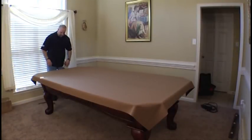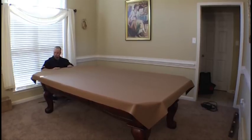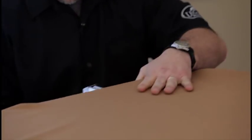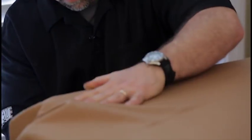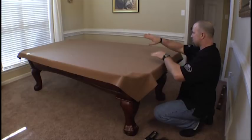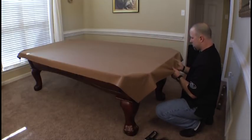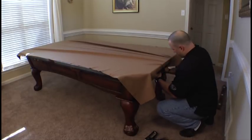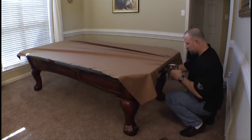You start at the end of the table. The cloth will be flush to the bottom of the slate and you just start — place a couple of staples in the backing. Stretch gently to one side and place staples about every six inches apart. Centering the cloth, come to the other end — that side is already secured. Now come to the center of the cloth and pull fairly firm, pretty hard. Hold that cloth down and place a couple of staples in the center. Once those are down, that cloth will stay.